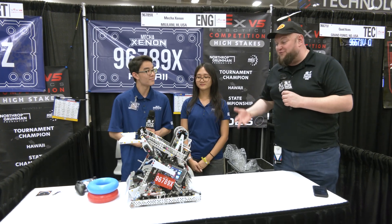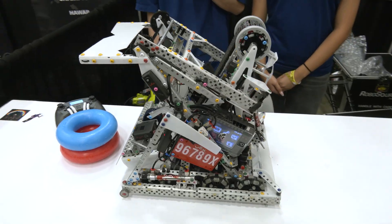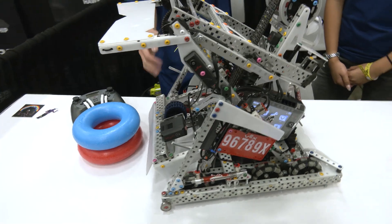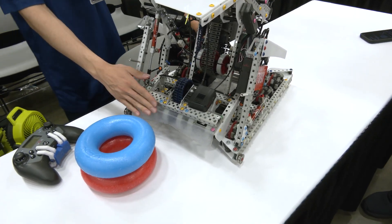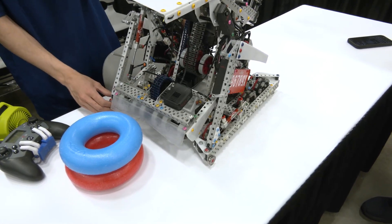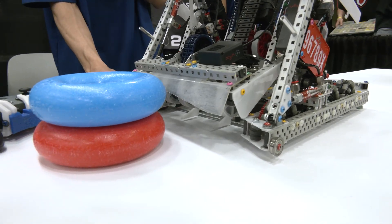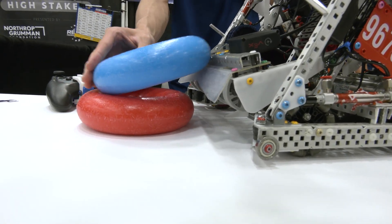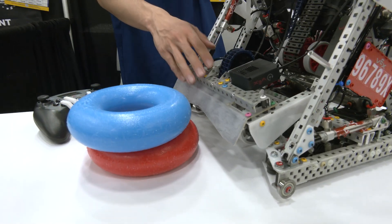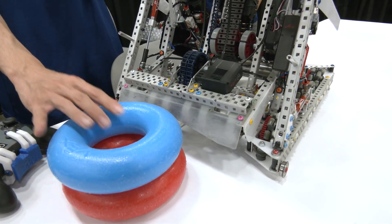Aaron, there's a lot to break down this robot. As mentioned, it's a full rebuild — but let's start out with the corner splitter. Walk me through that. Something really special about our corner splitter is that many teams don't run a C-channel over their polycarb piece or Delrin piece, but we're able to just crop and slice this part off. You can see how the ring just rides along the polycarb part and the metal part, and this allows us to keep the stability to hold the first stage of our intake, as well as efficiently take from the corners.